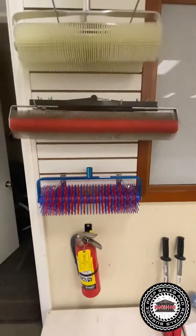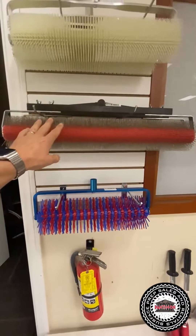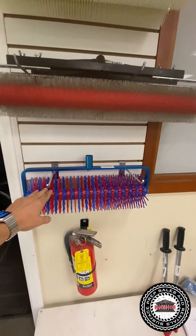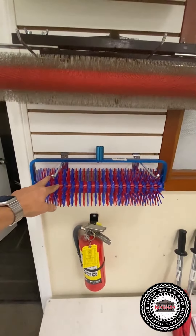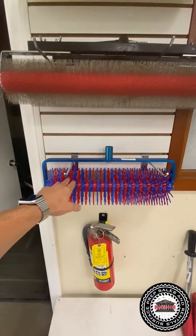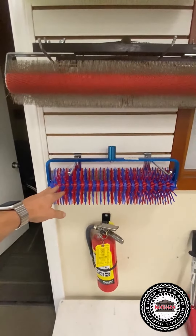These two rollers are mainly used for the True products. I'm going to go over why you use this one and why you use the metal spike roller. Number one, this product is used for the aggregates. You want to use it for the True PC or the True SP — their salt and pepper. This doesn't push the aggregate down. It's a very expensive roller, so make sure you clean it out at the end of the shift, and this will last a long, long time.